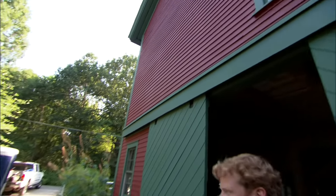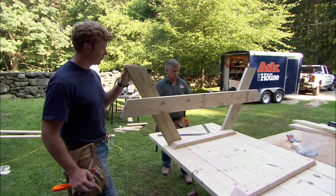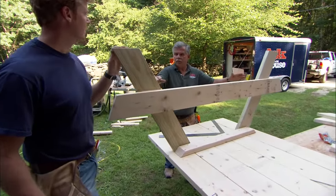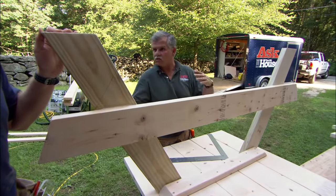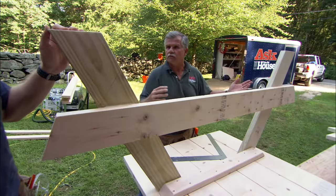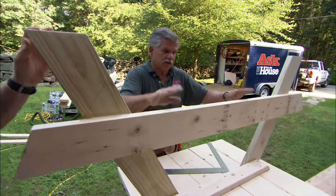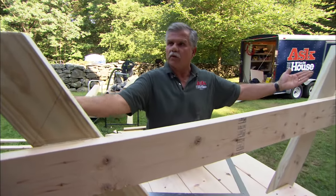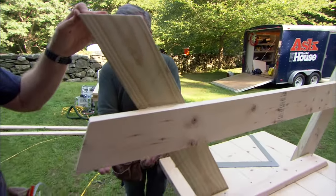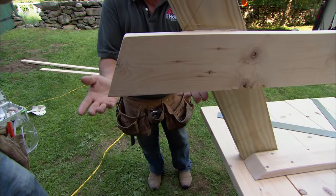Alright Kevin, I've got these legs on this side of the table just about set — let me show you what I have here. If you look, it's actually a basic A-frame. The A-frame gives the table a lot of stability. It gives it a wide stance on the bottom so it won't go back and forth — you don't want to be sitting on one of these benches and have the whole table flip up on you. Now this center part holds the legs together so they won't spread apart, but it also gives us a place to mount our two-by-sixes on each side to make up our bench.